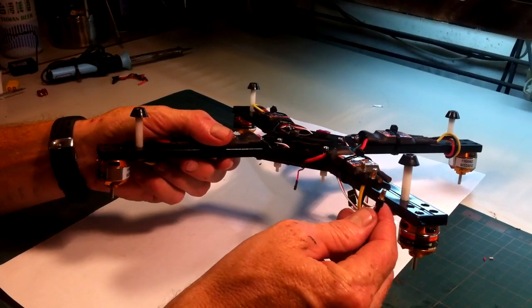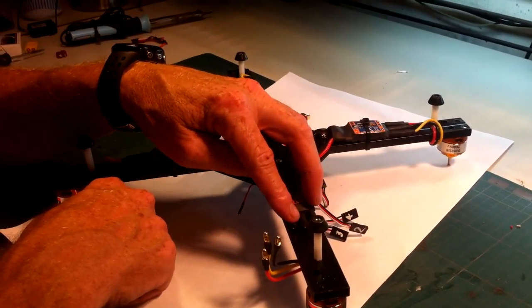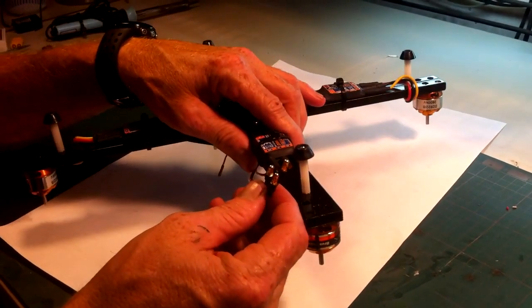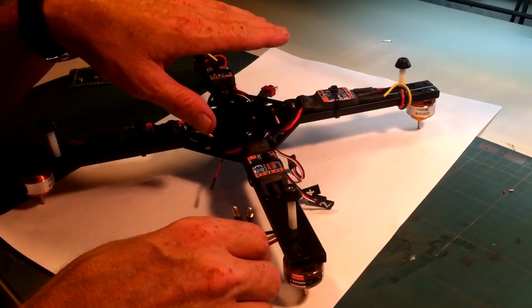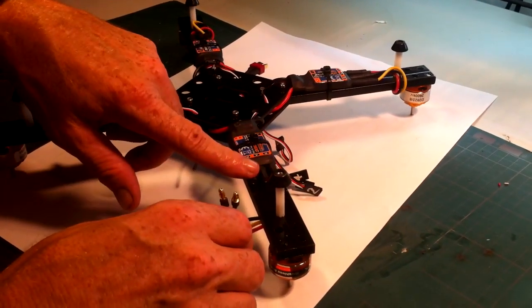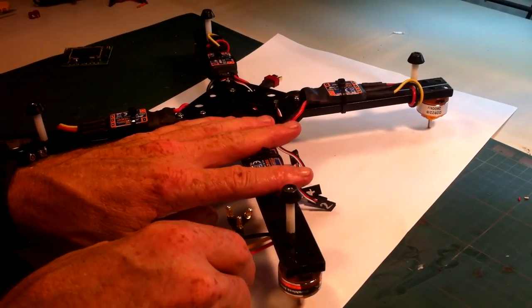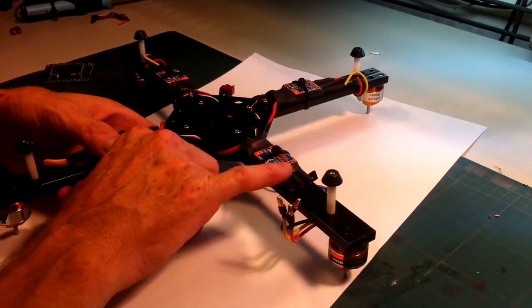You're going to have three wires for your motors, and on the ESC itself one end is always going to have three wires as well. You'll notice that on one end these connectors are male and these ends are female. This is because there's no current when it's unplugged, while this side is hot — it has power. You always want the hot side of a connection to use female connectors so that if they touch, you're not going to have contact, and this keeps your system safer.